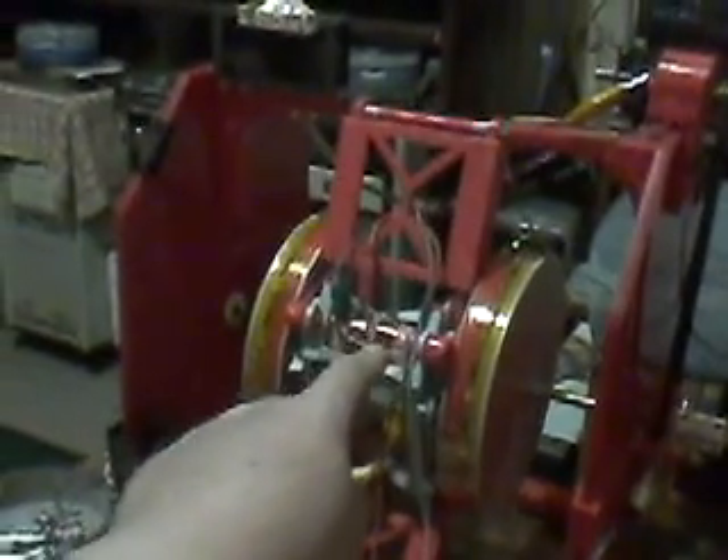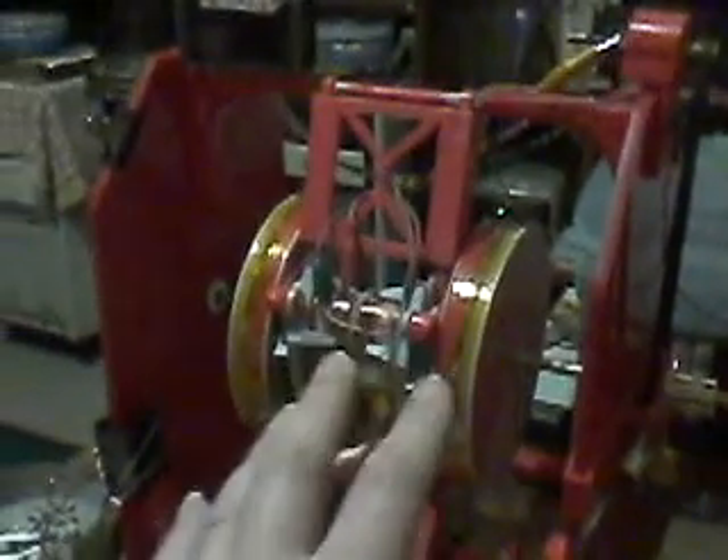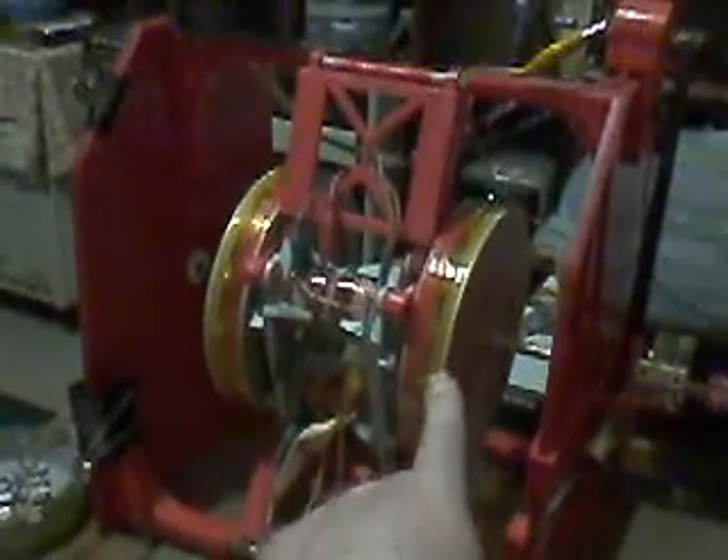As the rotor exits and the waveform starts to fall, the holding current of the TRIAC — which is around 10 milliamps — means that below about 9 or 8 milliamps the TRIAC will disengage and turn the output from the coil off, allowing the rotors to move out easily. Then the next cycle begins when the next magnet moves into the trigger coil. These coils don't have a lot of voltage output, which I think is just about right to trigger the TRIACs.